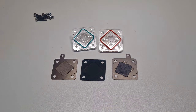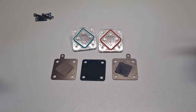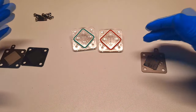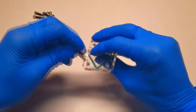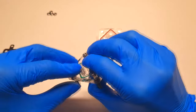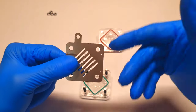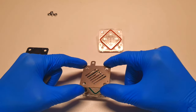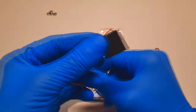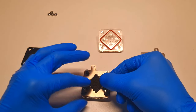To make this manganese hydrogen battery, I will use almost all the parts from this fuel cell. I will assemble the cell starting with the positive side. Into this end plate I will put these four screws, then I will add the current collector for the positive side. Instead of using the metal piece, I will use this graphitic carbon felt. This graphitic carbon felt will go on the positive side of the cell.